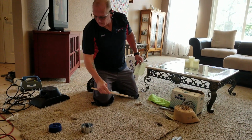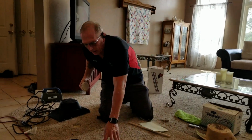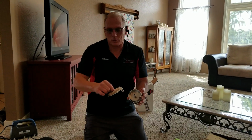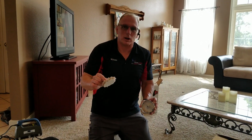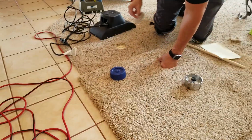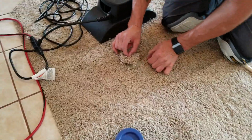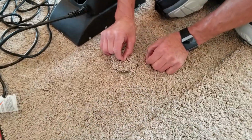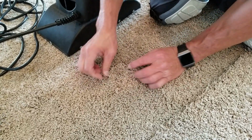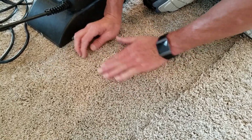So this carpet, once we stick this in, as you see, I've cut this out. They have a tool called the cookie cutter, and as long as it's 3 inches, otherwise we use measurements and we square out and everything else. But in this situation, we have a cookie cutter, and I've already cut the hole out of the damaged area. I've put the tape underneath, and we're gonna blend this in here very nicely.